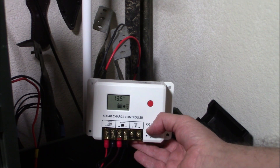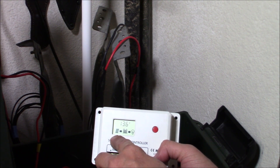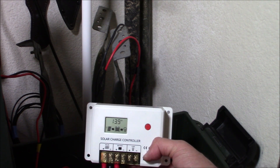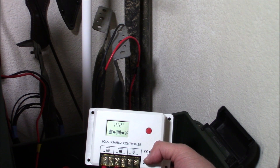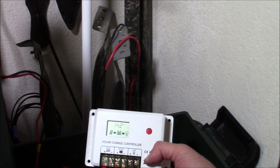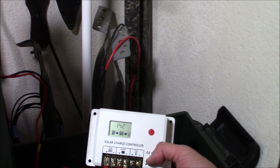Alright, it's all connected — it's in my little corner here, a really cramped space. Let me put the solar input in. There we go — showing a solar panel, voltage going up. I zoomed the camera in for you. So it looks like a successful installation. We are at 14.2 volts, right where I set it to hold. That's generally where you want it for gel cell batteries. Now all I have to do is put some double-stick tape on the back and finish up the installation.